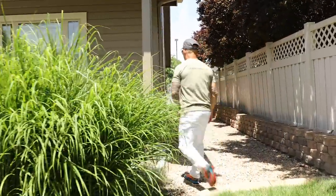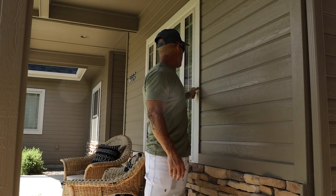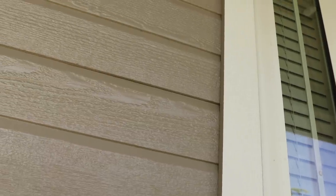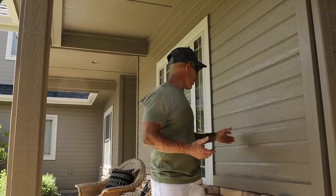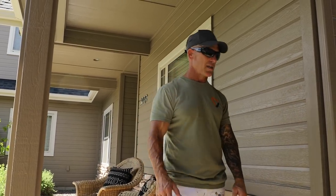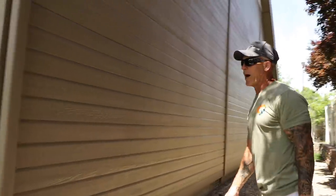Something people ask about is facing windows. The face of the window is painted the trim color. Here in Idaho, it's extremely rare to see the side of the trim painted — it does look amazing if you hand cut in that side, but it's a lot of work and you've got to charge for it. I probably would have charged around $500 to what we call 'French' the windows instead of just facing them.